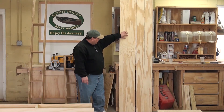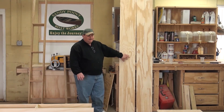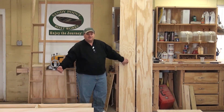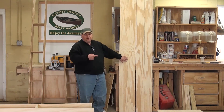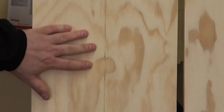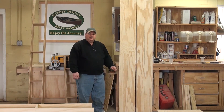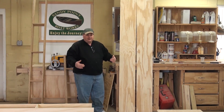Right down the middle you can see a cut line. You're going to need a very straight center line going all the way down your Strongback. The most accurate, easiest way I know of doing that is taking a board, flipping it over on the table saw, and cutting a thin kerf line right down the middle of it. It works out really well — it doesn't fade or go away. Chalk lines are fine too, but you don't want it so heavy and fuzzy that you could be off an eighth of an inch. You really want to keep your forms dead smack straight down the middle of the boat.